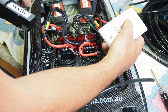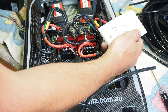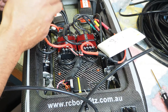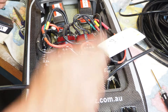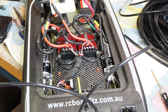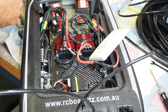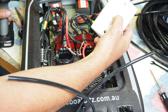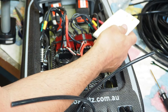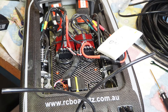Connecting up the power, we should have some beeping. That's good. Now it should be ready to go. I just need to get the prop spinning the right way, and I just realized I forgot to tighten that collet up. Collet's nice and tight now. I've programmed the throttle — I don't need to do that again unless I change the speed controller. It should just work normally now. I get three beeps because I've got a three-cell on each side, so this side's all right.